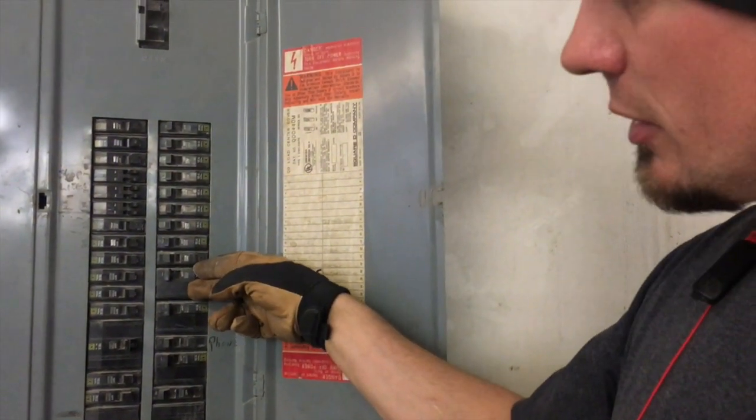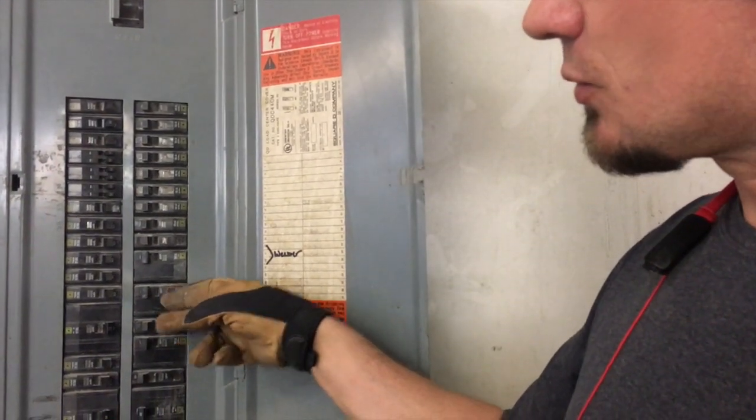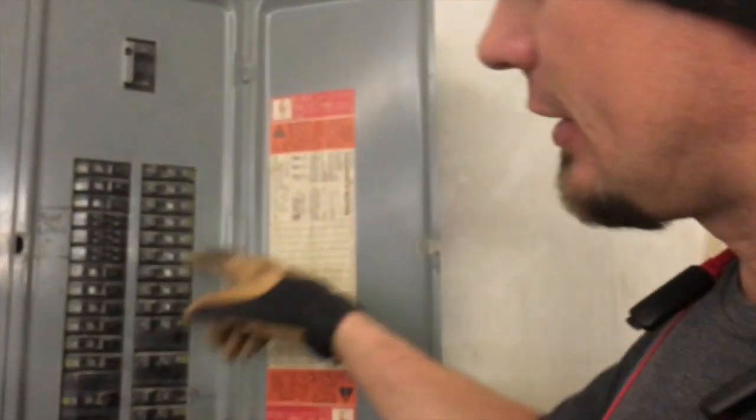When they're not in business and it's after hours, we're going to move this welder down to A and C. The dryer, which is hardly ever used, we'll move up to A and B, and then we'll have C and A on that panel. The bus bar inside here was actually a little discolored on the B phase, which is also where the wire feeder came in. Thanks guys.